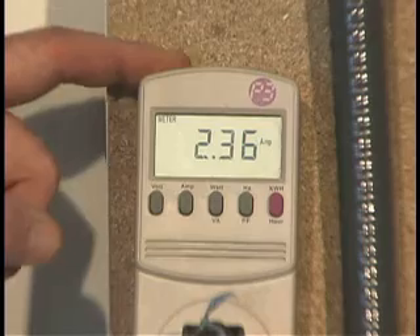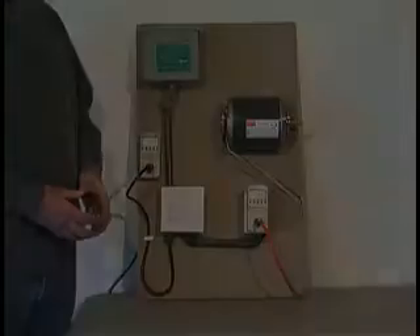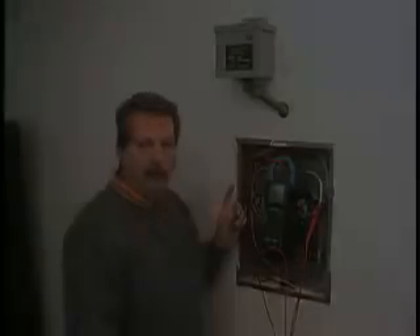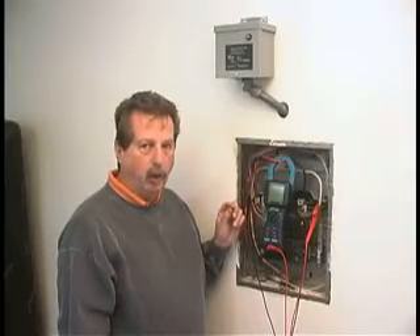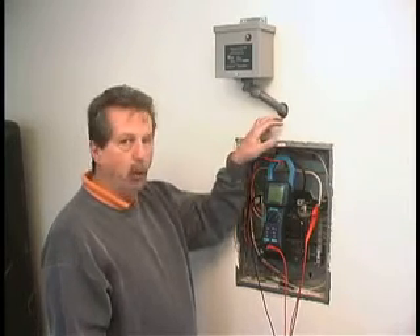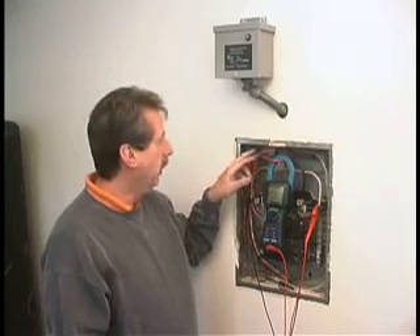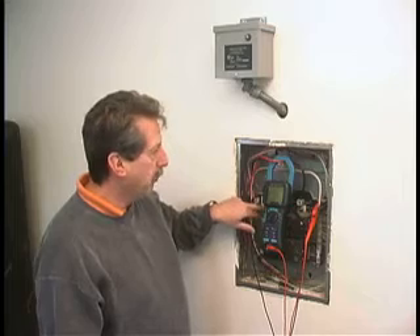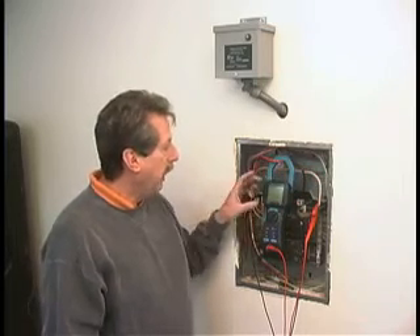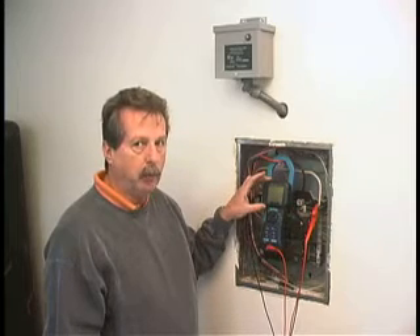The amount of amperage being drawn onto the board to support the motor is decreased, and that's where your savings occur. Here we have a typical installation of a PU-1200. All of our units are surface mount. In this particular case, there's been a hole drilled with the wires coming in the top. There are three wires — two go to a dedicated 2-pole 20-amp breaker, and one goes to the ground bar. The demonstration today is with a meter that will show us the power factor correction with the unit on and with it off.